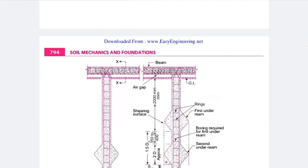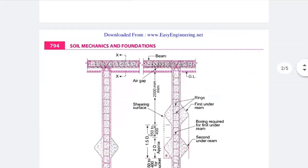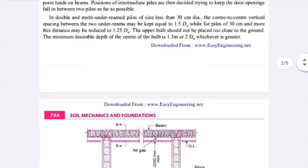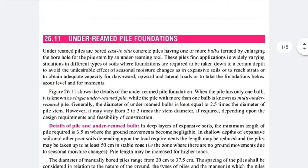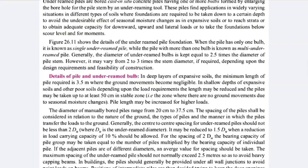You should calculate the diameter of the stem from the end-to-end dimension in horizontal direction. The bulb diameter is 2.5 times the vertical stem diameter; however, it may vary from 2 to 3 times the vertical stem diameter depending upon the design requirement. You can vary the diameter of your under-ream bulb based on your experience — if required, you can take 2 times, 2.5 times, or 3 times.